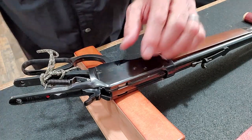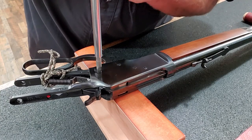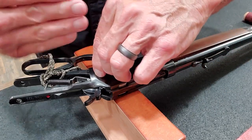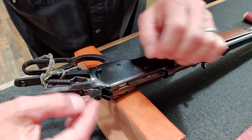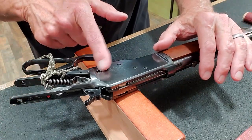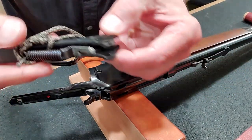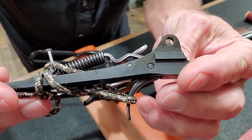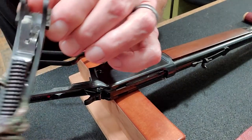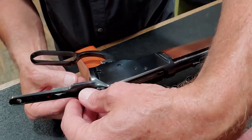With the hammer pulled back, we're going to take out the hammer screw using the same screwdriver tip — at least on my rifle. When you pull the trigger it drops the sear, so the sear is not putting any upward pressure on the hammer. Now the hammer is just free-floating and this screw will come right out very easily. We'll set that aside. With that screw out, the lower tang just pulls right out — and there's the lower tang assembly. Now the hammer will just drop right out the bottom.